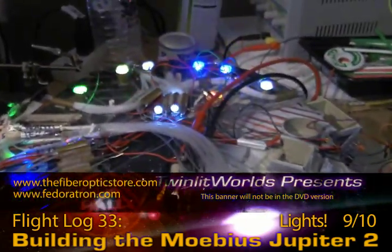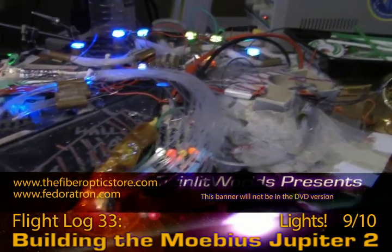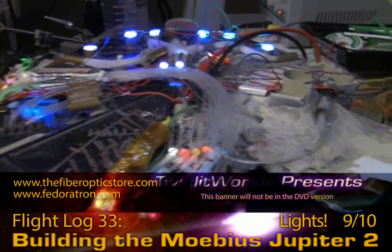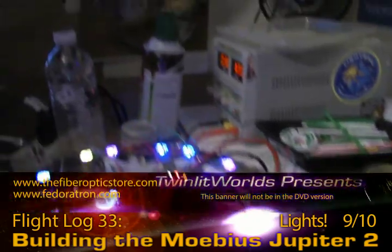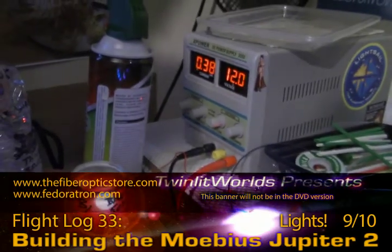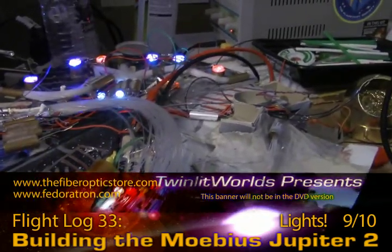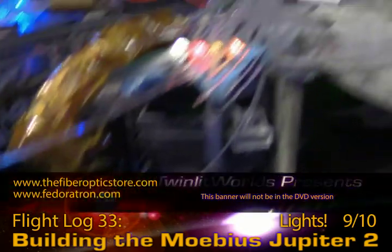Right now I just wanted to kick back and watch all the LEDs flash. If you want to see what this looks like from the top side, we'll do that in another video. I've got the soldering iron on standby, power's running at 12 volts, and so far all of this action is only consuming less than 0.4 amps. I'm really hopeful to keep the entire model down under 2 amps, and that's with the computer wall plugged in and running too, keep in mind.